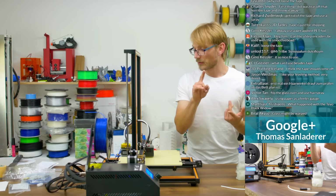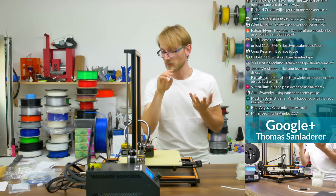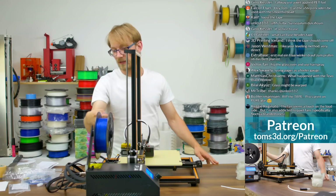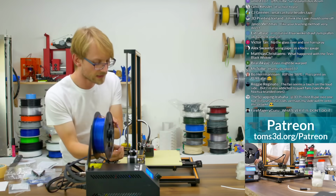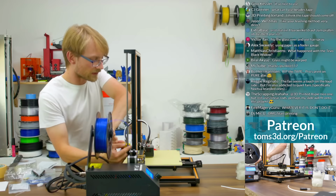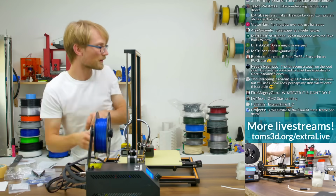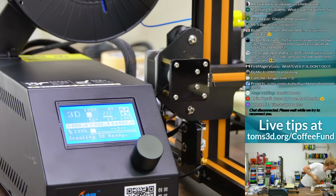Okay. What do we have? We have the bed leveled, we have the machine assembled, we have stuff connected. We do need to load some filament. I'm going to use the Beta PLA Electric Blue Special Edition, basically. Let's use these snips right there. So we don't have a load filament point in the menu, so I'm just going to assume we do have to do it manually. Okay, back it out a bit and let's preheat this guy. Right here. Good enough.